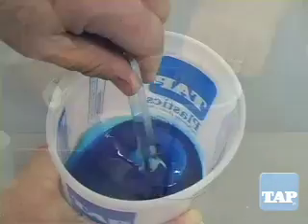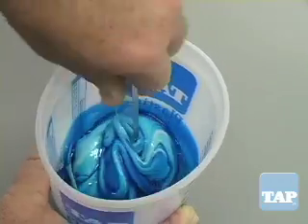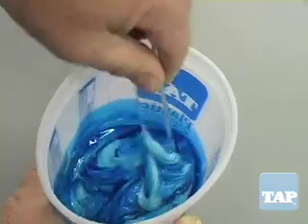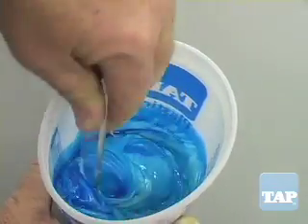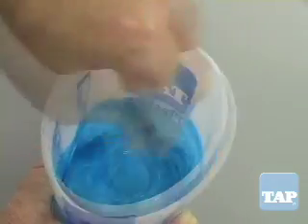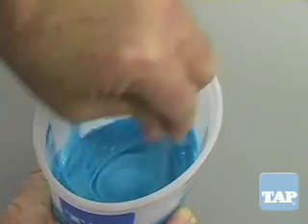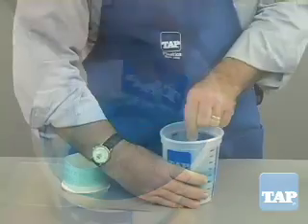As you can see, it is a challenge to mix a very thick and a very thin liquid together. Fortunately, the hardener is dyed blue or green to help us see when the mix is complete. Incomplete mixing will result in incomplete curing, and unlike cured silicone, uncured silicone is very difficult to remove from the part. So great care is required in order to produce a thorough mix.